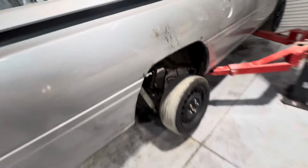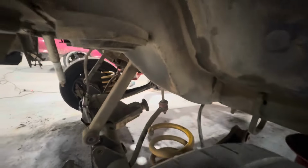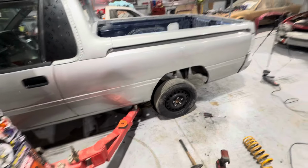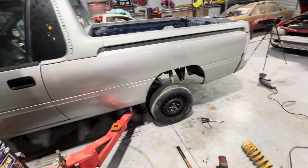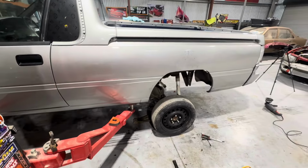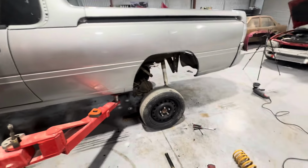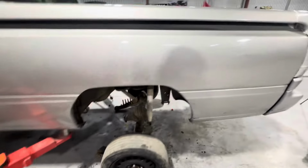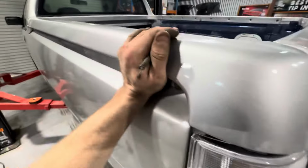So I'm just coming out with the suspension. Just got to undo the sway bar link nuts, and then it should drop down. So there's always one thing that seems to get left behind, and I left the bloody handbrake cables connected, so not to worry. Got them off now. Just want to make sure the Ute's going to be sturdy and doesn't want to flip.